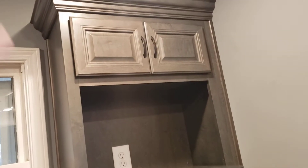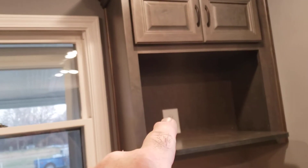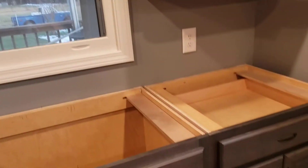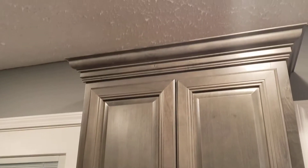On the microwave cabinet, all those are complete. Microwave installation cabinet - those are done. We did have to move the outlet up two inches from where it was so it would clear the bottom floor of the microwave. Base cabinet here to the right - sink base 39 - all that's in good shape, no problems. 27 wall cabinet in good shape.